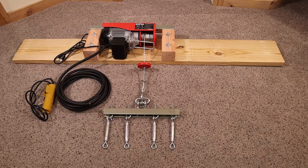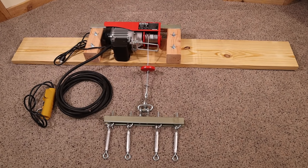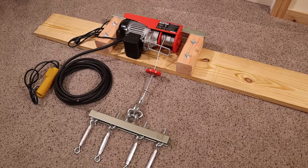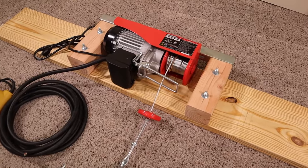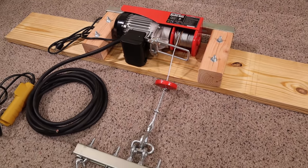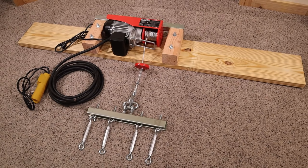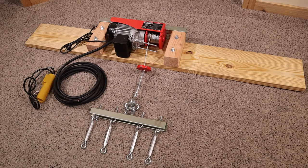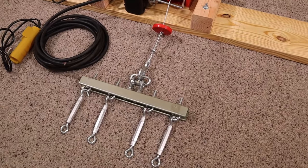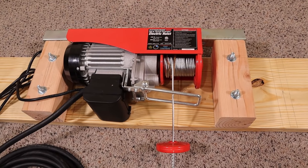Here's the heavy lifting part of the project — the thing that makes it all work. I'm using a relatively cheap Harbor Freight electric winch rated for 880 pounds with a double loop going through a snatch block. This is only a single stretch of cable, so it's only rated at 440 pounds in this orientation. I have it connected to a 2x10 with two 4x4s on either side and then a piece of super strut on top. I ran an additional wire — I'm not going to show you how to rewire this thing, but I have a wire extending the length of the controller. The big thing you need to be aware of is you can't use Romex for this wire — you have to have four insulated conductors. I'm not a professional electrician so I don't want to go too deep into that, but it did end up working out really well for me.